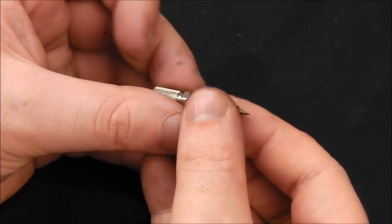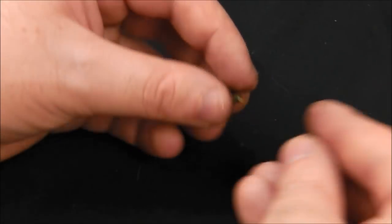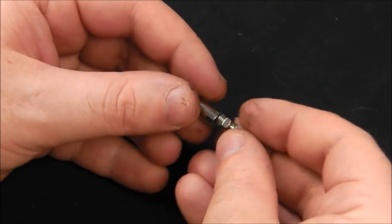Normally what I'll do is fill a plastic shot glass full of thinner or cleaner, give the nozzle a bath for 24 hours to loosen up anything that's stuck inside, and then come in with the reamer for a quick clean, and then follow up with those brushes.